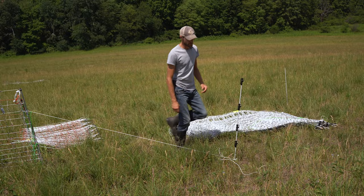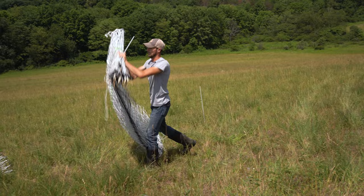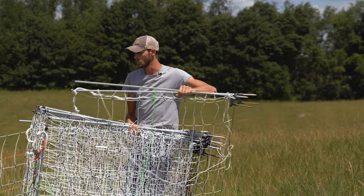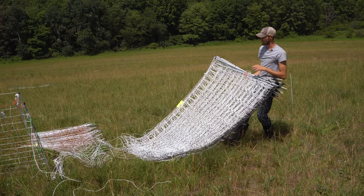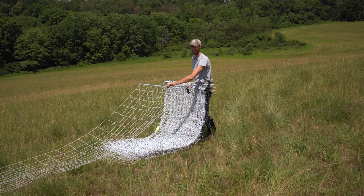I'm going to go ahead and pull the anchor post from the previous net and get it out of the way. With all the posts in hand, I find my next anchor post and the very first post and chuck it up against where that fence leaves off. Then I walk backwards, pull the slack out of it, and that reveals which post is next. I give it a little toss up in the air as I'm walking backwards so that it separates and doesn't snag on anything.